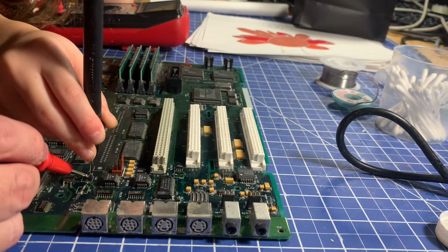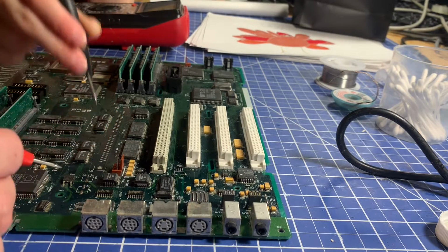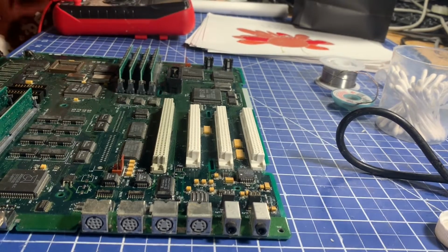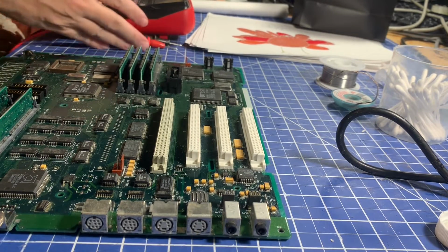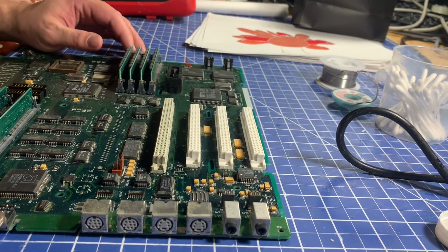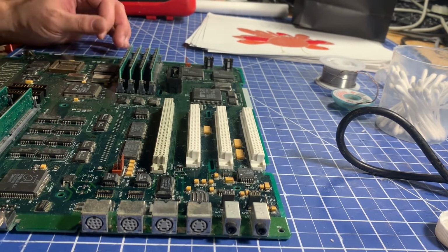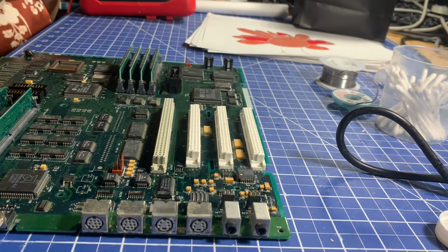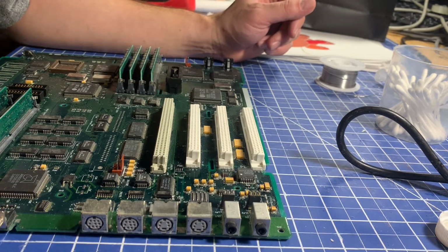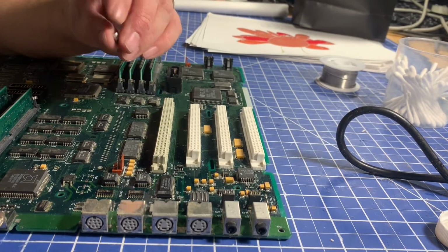All right. So that pad is there. I think we can solder to that still. It just looks a little sketchy, but I think it's going to be okay. And it's unfortunately the positive side. If it's the negative side, the pad lifts. Well, don't drag that across the board. It might damage something. You can keep playing with it, just don't drag it across stuff. If the negatives are bad, you're usually really easily able to loop those together, because negatives are typically common. Again, you want to check to make sure, but if it's the positive side, then it does need to be its own connection.